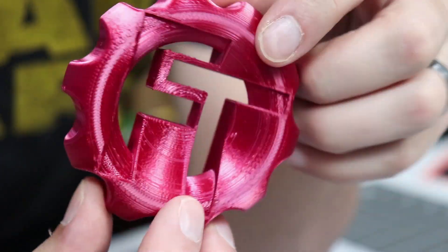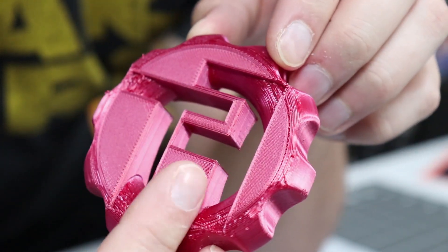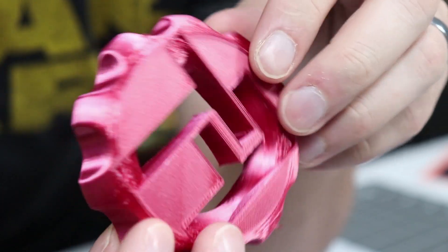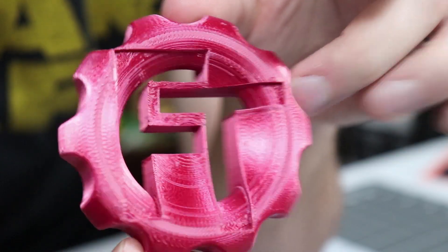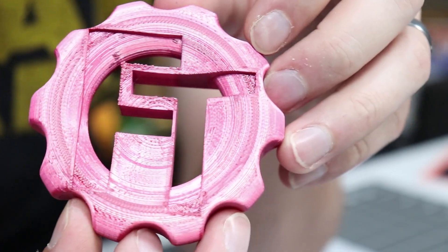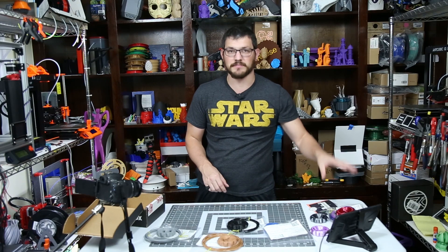And lastly we have the Merlot, which again is very, very nice looking. This was printed on my Ender 3, on their flexible build plate, so there's a little bit of texture on the bottom. Super great on all of the overhangs, and where support was it did a great job. These are all printed at 215°C on the nozzle, 60°C on the bed, and all printed at 60 millimeters a second. So that was the MakerBox Easy Box.